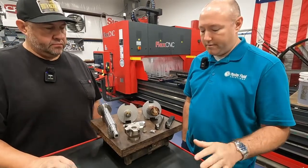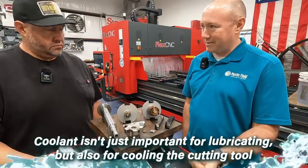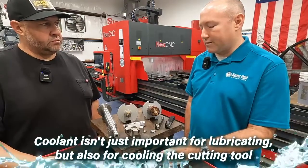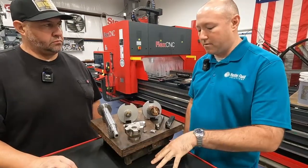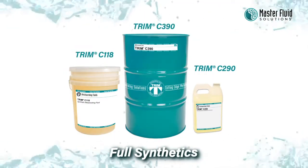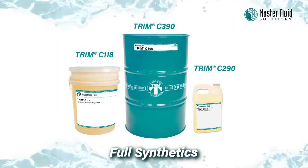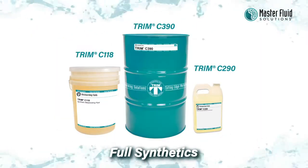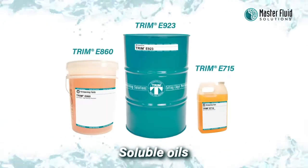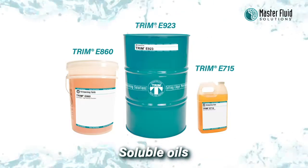Coolant plays a vital role in both lubricating the cutting tool and cooling. A full synthetic, which is very water clear, is very good at cooling — water is a very good coolant just from removing heat. Then you add some lubricity in your synthetic, whereas a full soluble oil has a lot more lubricity. It'll generate less heat, but it's not as good on the cooling side.